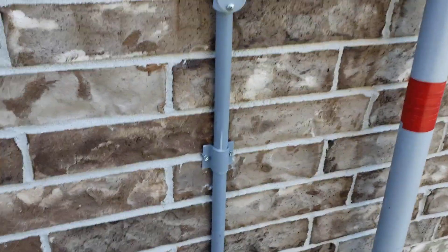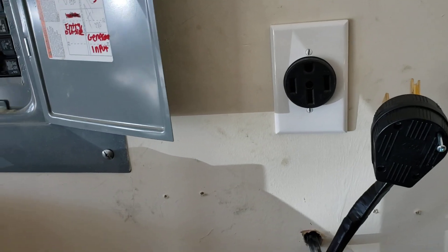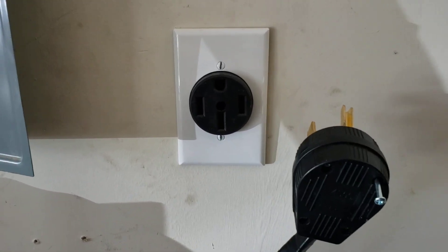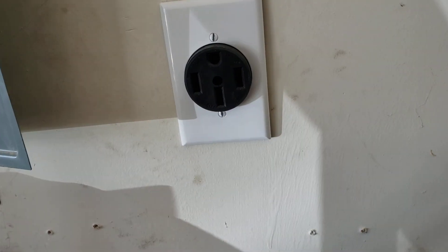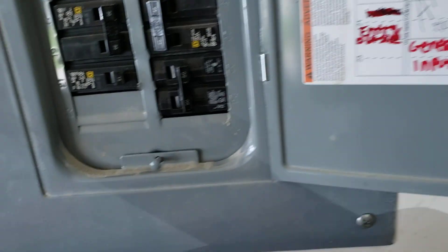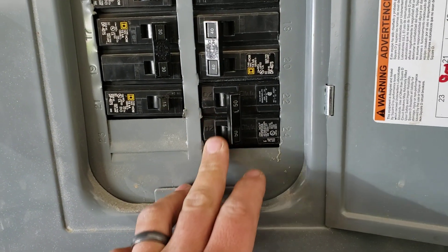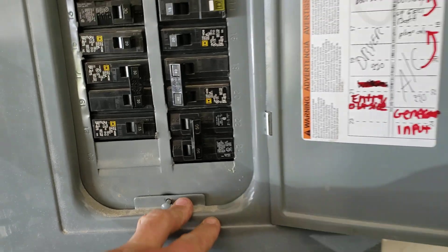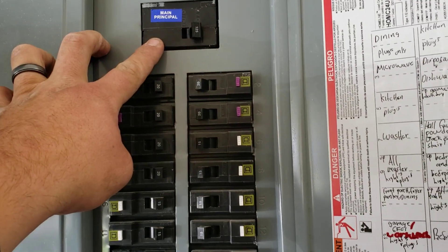There's conduit here, a conduit box, and it's nice and sealed. From here I have the 240-volt dryer plug rated for 50 amps, with the cord going in from the wires outside. I ran in a new 50-amp 240-volt breaker on the bottom for generator in. So all I have to do is flip this on, flip this off for the main, and then everything else lights up.